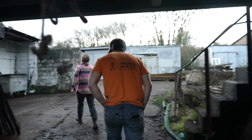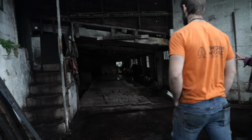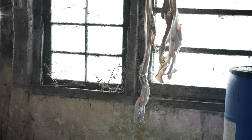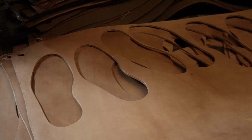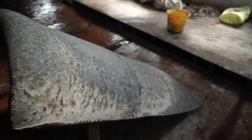The hides then enter into the old 16th century lime yard, which is where each hide is individually inspected. They look for scars, size and thickness, and it is then decided what type of leather each hide will be used for. Some are used for shoemaking. Other long hides with no scars on them are used for backs for the harness industry.